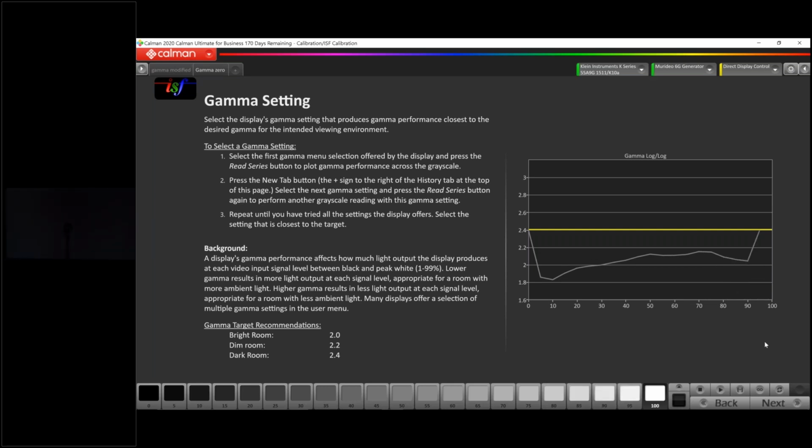Okay. Kind of weird, not great. Let's do this. I'm going to take 90. Let's see here. 90 is still quite a bit too bright. So if we go 90, I'm going to go down a lot of clicks. Let's go to -20. I don't like that many clicks a lot of times. It can cause some weird artifacts and banding and things like that. So it's really important here when you're making these adjustments to also look at some content. Make sure you're not causing any weird issues.